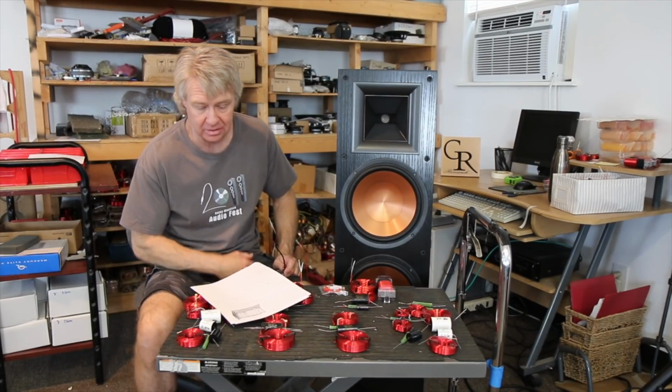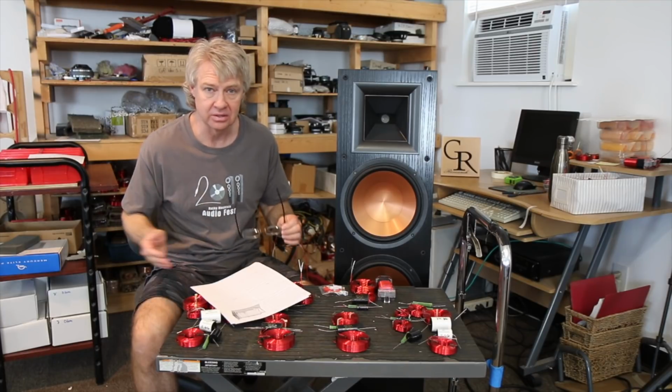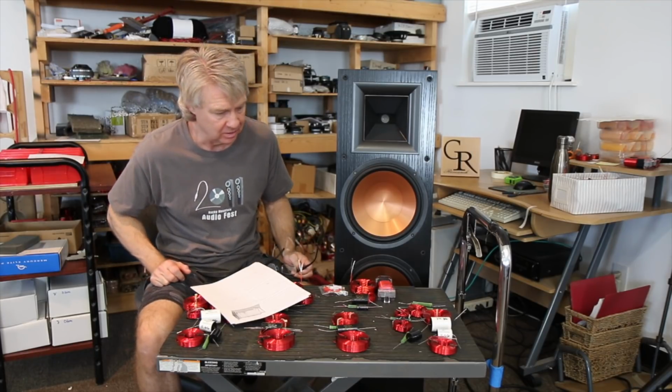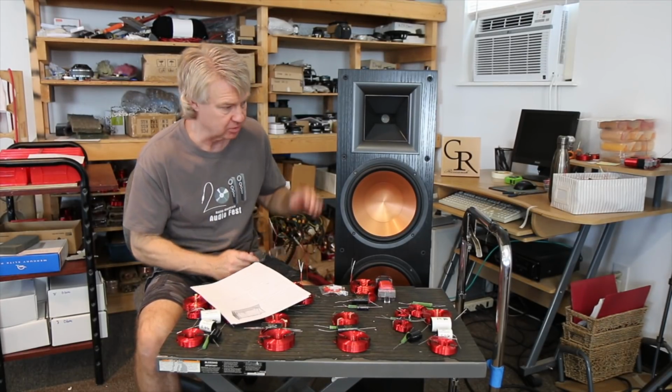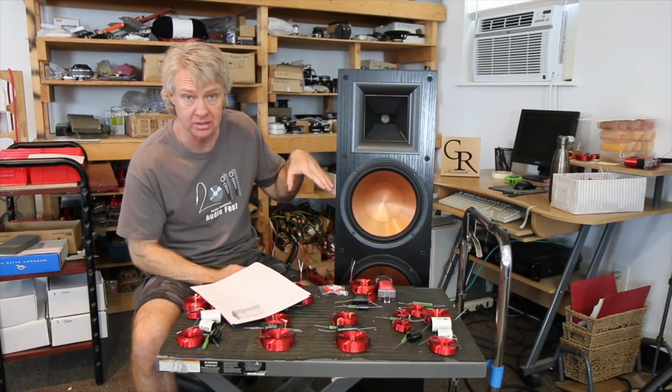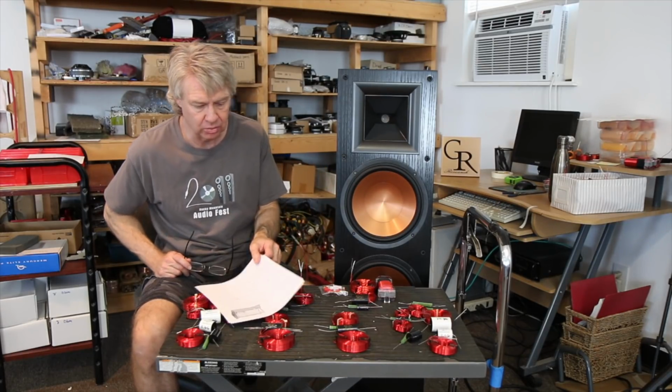So there's a lot of options there. I didn't try to go off in that direction because that's creating an inconsistency that you wouldn't be able to replicate. So I left the tweeter as is, just added that little inductor across the top to try and pull some of that high frequency out of it and to smooth the whole thing up. So this is where it ended up.